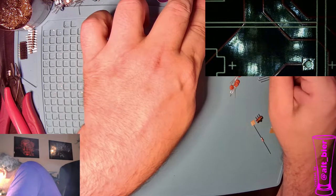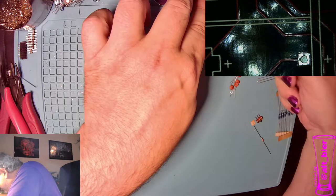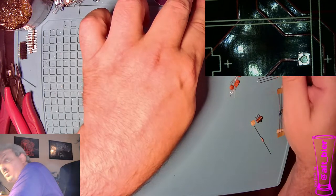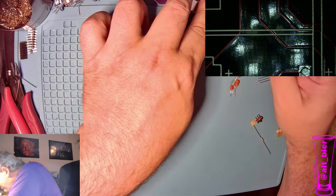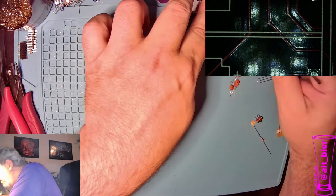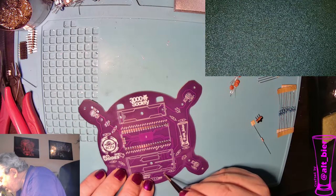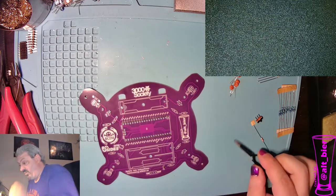And we're going to want this guy, if I can get him the right side up. So you'll see on one side the legs are towards that side, so it's easy to tell if it's flipped over. And once it's flipped the right way, there's only one way it'll go onto the pads. So let's go ahead and solder this guy. And the way I do this, just kind of line him up so he's right on the pads where we want him.